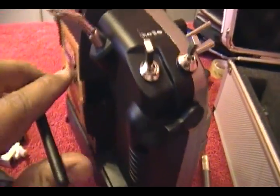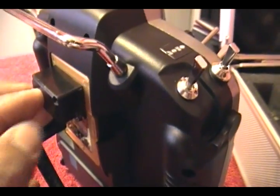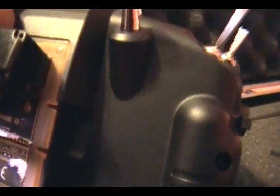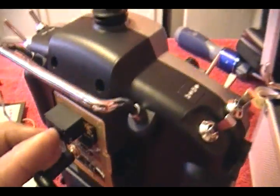I'm going to do it the way some models come - add a box on top of the orange model. I really wanted to use this bigger 40 gram servo box, but it covers my bind plug on the bottom, so that eliminates using that one. I'm going to go with the smaller 9 gram servo box, which is actually better because it's lower profile, the antenna will be lower, and it clears all my switches.